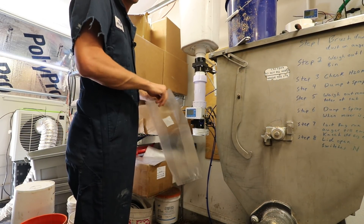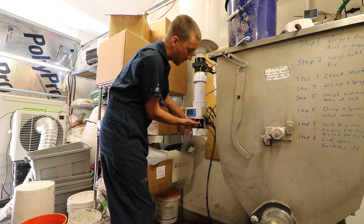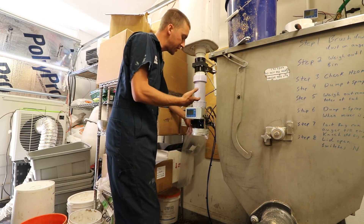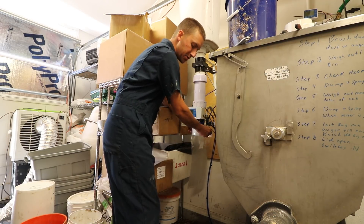The pneumatic valves cost me about 50-60 bucks, but they fluctuate between 40 and 90 dollars. When I press the pedal, an airline comes in the bottom of the box and hits a switch, which is wired to the back of the run button.